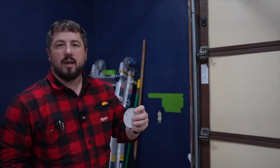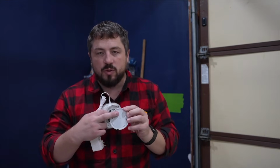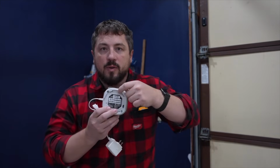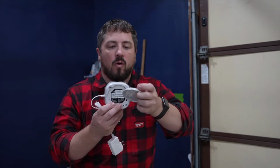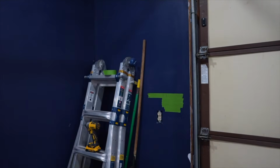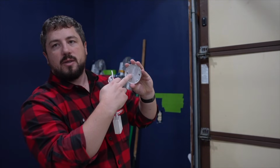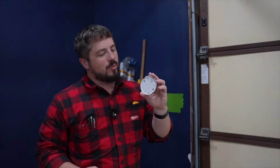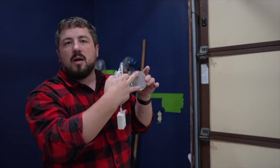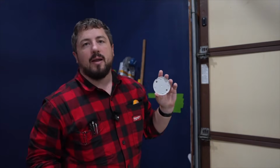I look at my installation plate for the hub. The installation plate shows you what is vertical, which is right here, and it matches up with your little up arrow right here. So I know what is up. Now the actual drill holes are laterally. The thing that makes this a little undesirable is if it was vertical, I could just screw these two right into a stud and be done. But because they're lateral, I can't do that because studs aren't that wide.